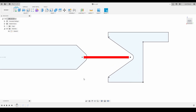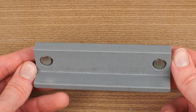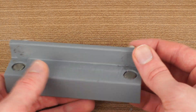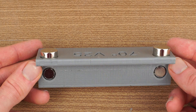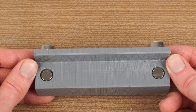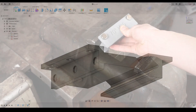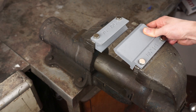In order to quickly exchange tools, I went with magnets to fix them to the vise. First I used 10x2mm disc magnets, which are way too weak, and then switched to 15x10mm disc magnets. These fix the tools fairly nicely, however you have to be extra careful not to get anything magnetic near them. Therefore I would recommend to just go with multiple smaller ones. Create some pockets in your 3D model and use glue to fix the magnets after printing. Depending on the cleanliness of your shop and the material you are working with, you might want to fully enclose the magnets or at least put some tape on them so they don't collect all the steel chips that might be present.